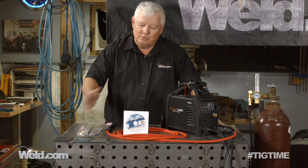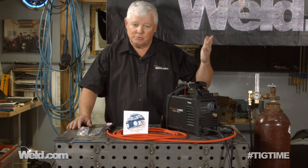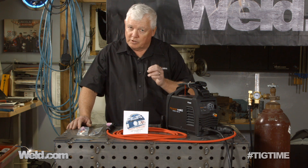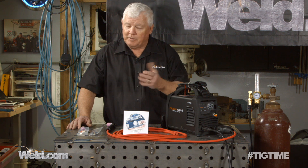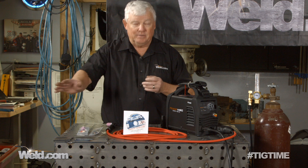I'm excited about this machine because I've never found anything that low in cost that will do that kind of a job. I'm going to give it a Mr. TIG Thumbs Up. You have a scratch start, and when you terminate your weld you actually have to pull away — you don't have a foot control, so just remember you don't have any argon shielding over your puddle. You won't use this for aerospace applications, but you will use it for auto body restorations, hand rails, things like that. It'll cover everything you want.